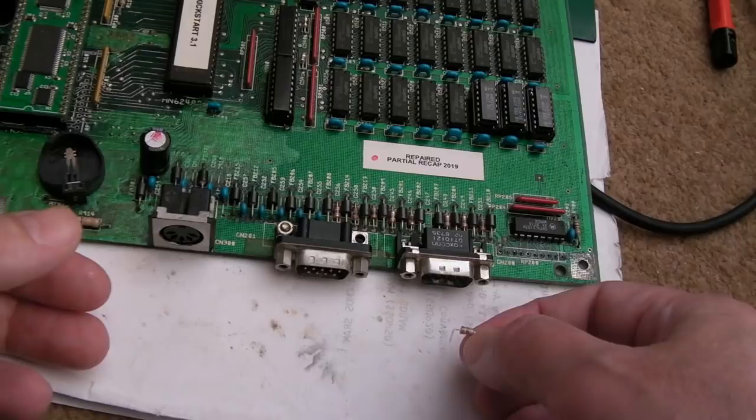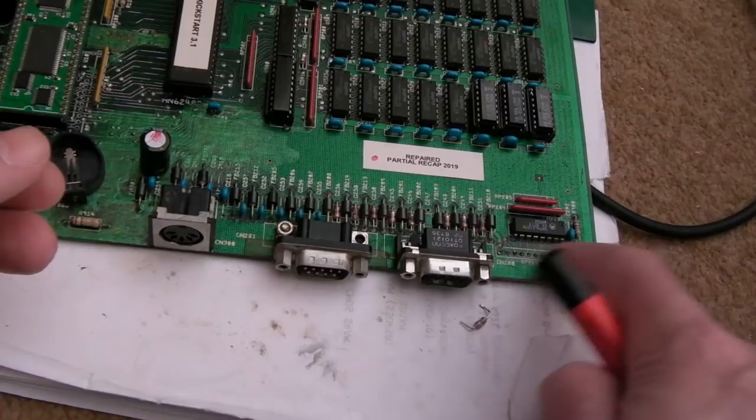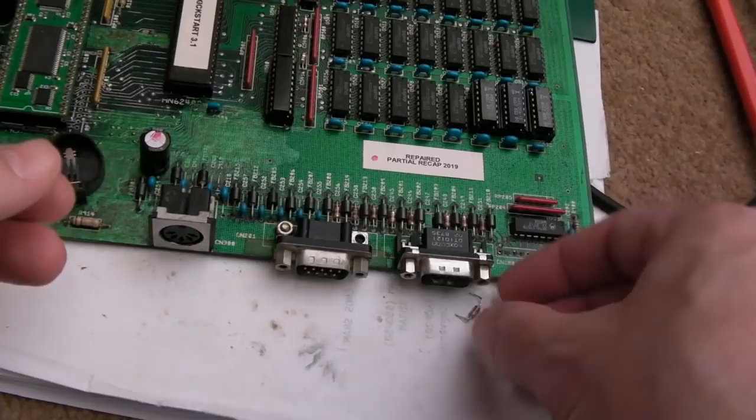So, I don't know, I'm really confused. I hate problems like this. So, gonna get the fiberglass pen, this isn't it, this is a wire brush, onto there, and onto these things here, get a bit of flux on there, a bit of desolder braid, mop up the things there, and maybe consider getting the resistor pack back on. I think the next thing to do might be to take this off, actually, and see if our weird resistances and things disappear. But it could still be corrosion around this port, maybe.